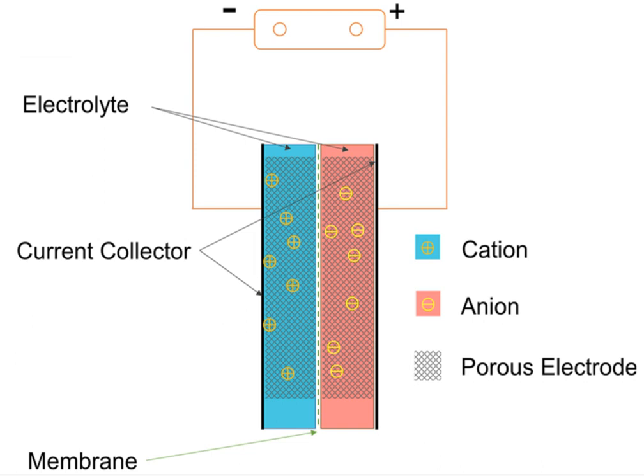Polarity. Since the positive and negative electrodes, or simply positrode and negatrode, respectively, of symmetric supercapacitors consist of the same material, theoretically supercapacitors have no true polarity and catastrophic failure does not normally occur. However, reverse charging a supercapacitor lowers its capacity, so it is recommended practice to maintain the polarity resulting from the formation of the electrodes during production.